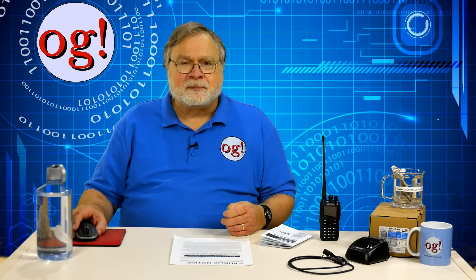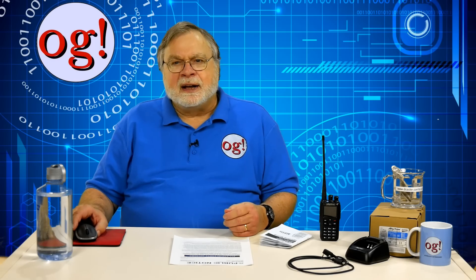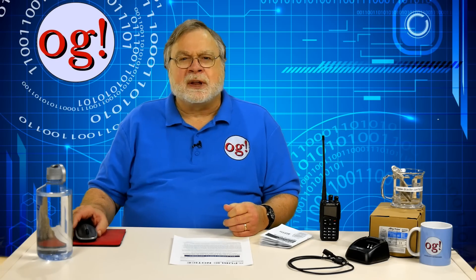Note that when the screen is active, the radio's keys are also backlit. There's no flashlight on the radio. The rig also receives the FM broadcast band. You'll have to program a PF key to get there, as I can't find any other way with the rig's default setup. I chose to use a PF1 long press to toggle the FM radio on and off. You can add channels in the programming software. Punch in the frequency directly up to the megahertz and then use the VFO knob to set the digit after the decimal point, or just roll the VFO knob to the frequency you want.